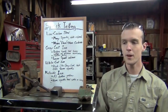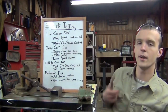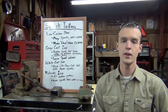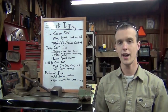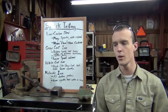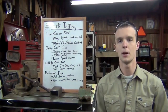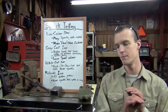Now let's talk about spark testing steel. It's going to have a lot of sparks, and the more sparks it has, the more carbon content it's going to have. The sparks are going to be white colored. If you take a piece of material with a low carbon content and a piece with a high carbon content and bend them over something, the lower carbon material is going to bend and the higher carbon material is just going to break. That's why, in a nutshell, cast iron is so difficult to weld. The steel can kind of bend with the heat, but cast iron, because it's not as ductile and has a lot more carbon, is just going to snap and crack. Carbon content is probably the main thing that determines weldability in pretty much anything.